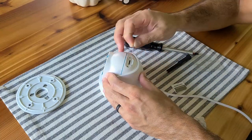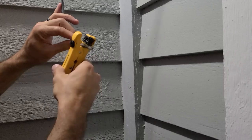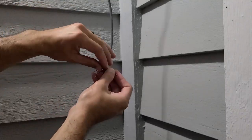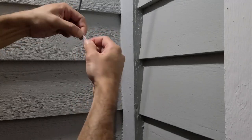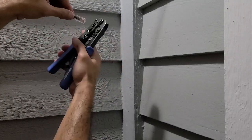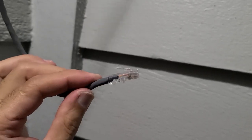Starting with the pre-install, there's some preparation work. You want to install your microSD cards ahead of time — on one camera I forgot, and it's not easy trying to do it when the camera's upside down at the top of a ladder. From there you want to run your cables and terminate the ends. I'll briefly go over the termination process: I started by stripping back the insulation, then separated each wire and sorted them according to the T568B standard before crimping on the RJ45 connector. When you crimp on the end, make sure the connector grabs the outside insulation and the individual wires go all the way to the end to fully make contact with the metal contact points. If you're feeling adventurous you can crimp your own cable end, or just purchase pre-made long patch cables.